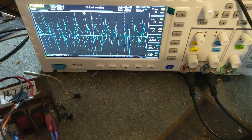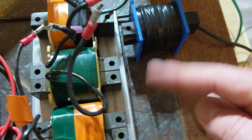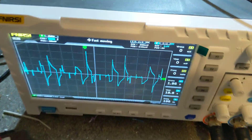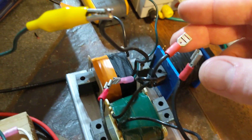Now I've got the scope hooked up to a pickup coil out here — it's not hooked up to anything, just open. This is just to measure the magnetism in this rig. Right now that coil is picking up 1.93 volts. Now I'm going to short the pickup coil — watch what happens to the magnetic field.